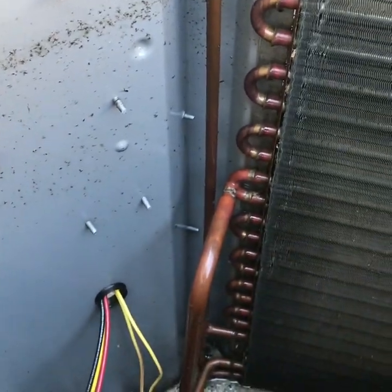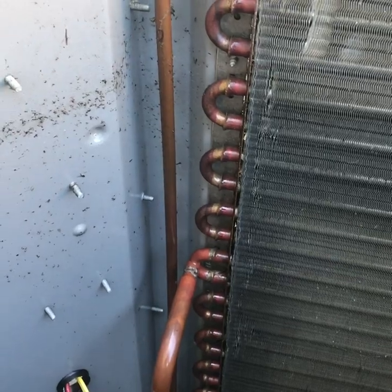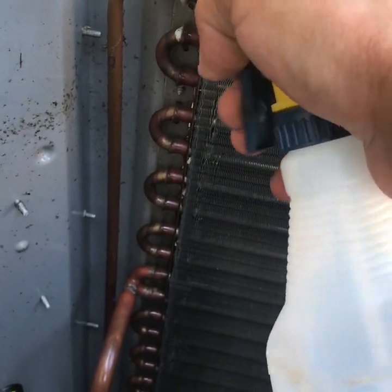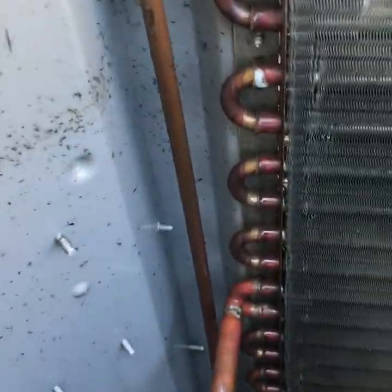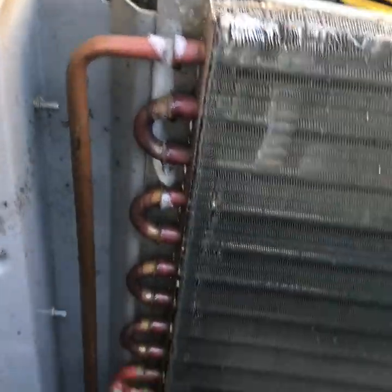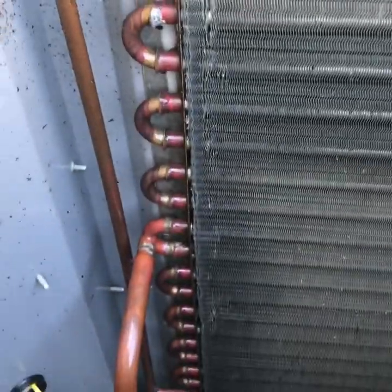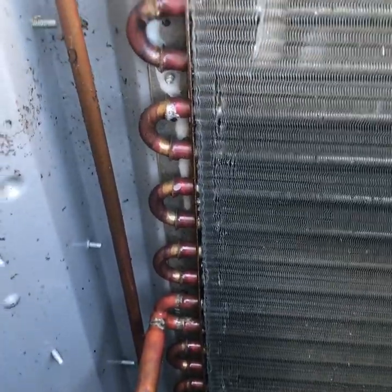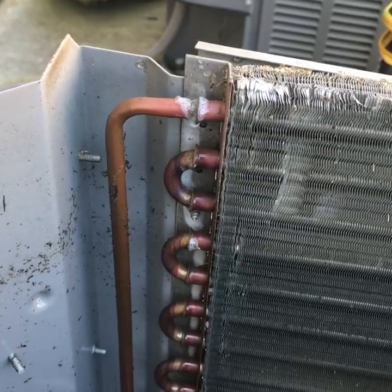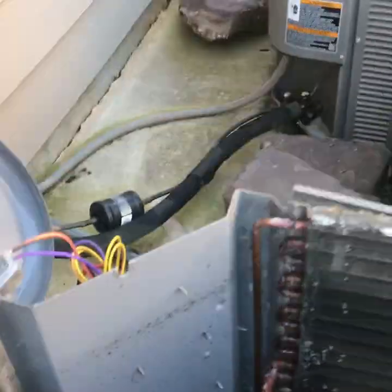I've seen a good bit of oil all over these little loops so I went ahead and sprayed some bubbles. A really good way to do it so you don't use so much: spray it on when it's liquid - it's not real sudsy like that - and it'll run down every single joint and keep dripping. Make a few squirts at the top and it'll run all the way down. But there's only about 30 psi on the system so I'm going to put some nitrogen in it now and respray with more bubbles.